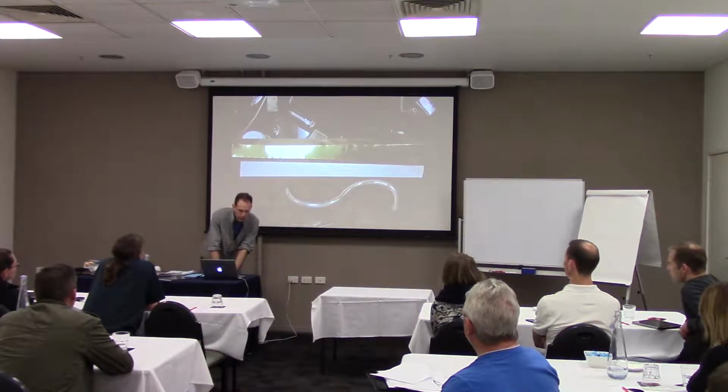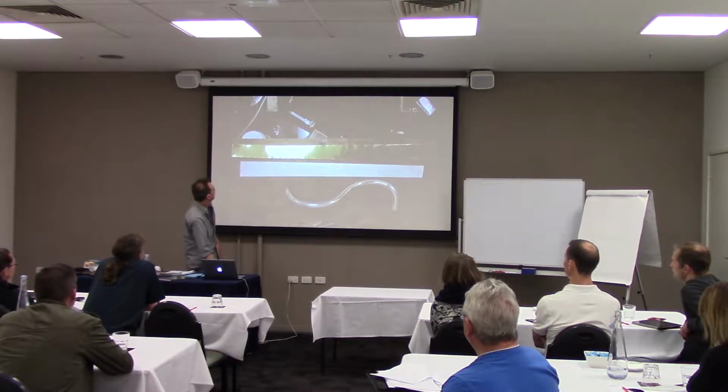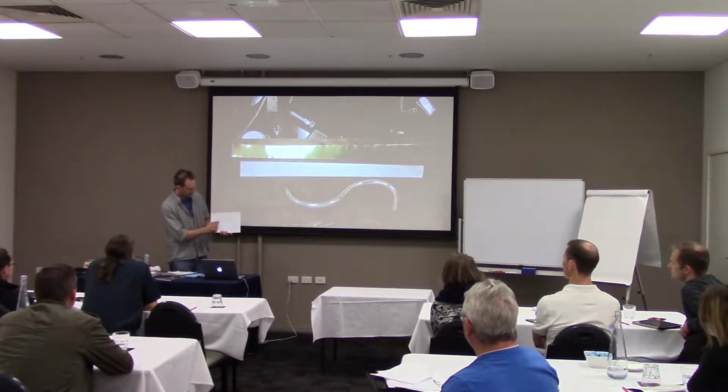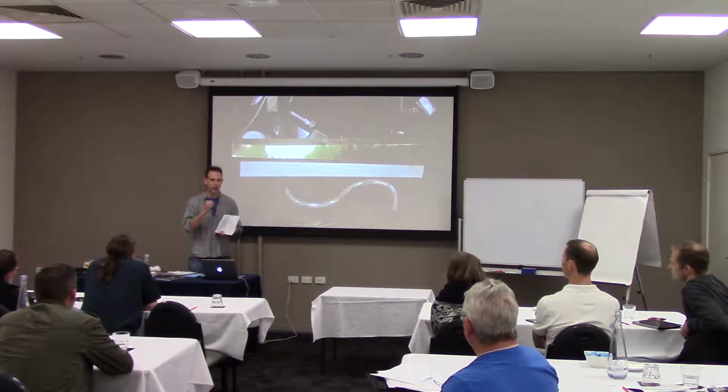So that's my pattern that I'll make. What I do is I take measurements every 200 thousandths, and then I subtract. Like on a saxophone neck, I'll measure every 200 thousandths, and then I subtract the wall thickness. Sometimes in areas, especially on one that's been used like this, or on some necks that have been pulled down, you're going to get distortion in the bore. So I'll take a couple measurements, and then I'll take an average, because, you know, what are you going to do?